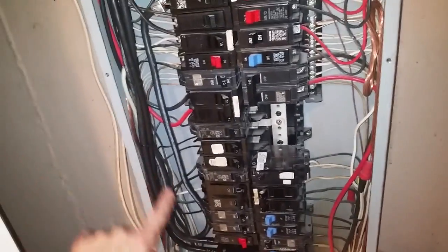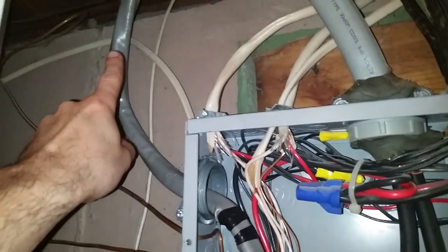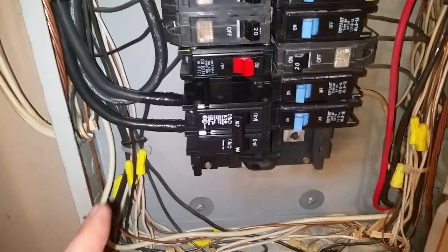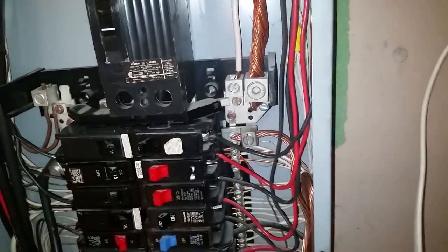When you run your cable in, make sure you loop it and leave enough wire in case you need to move the breaker in the future. This is the service entry cable coming in on a Romex connector. Cut it a couple of inches inside the box, and feed the wires into the dual pole 100 amp feeder breaker that feeds the garage. Since I'm running 220V to the garage, I need a dual pole breaker. In the main panel, neutrals and grounds are bonded together, so it doesn't matter which bar you connect them to.